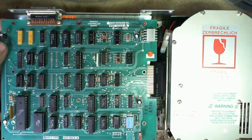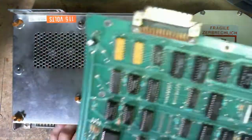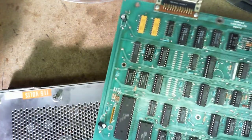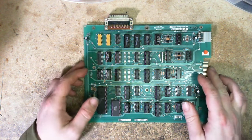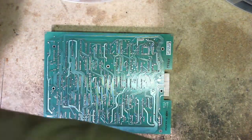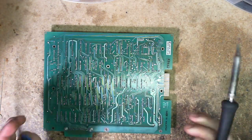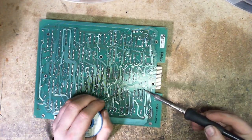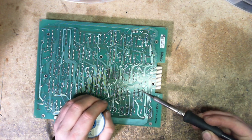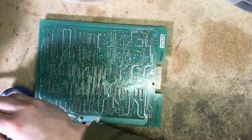I'm pretty sure if this socket here sucks, the rest of them on here suck as well. But unless I start running into problems with them, I'm not going to change them all out — just take a look how many sockets there are on this. I'm just going to tint it with a little bit of solder so that the desoldering tool gets a little bit of an easier job. And it's a 14-pin. Let's turn my temperature up on the iron — 640 degrees.